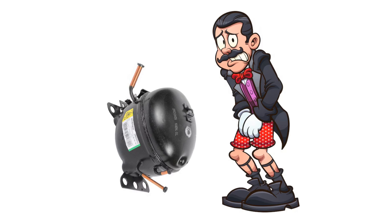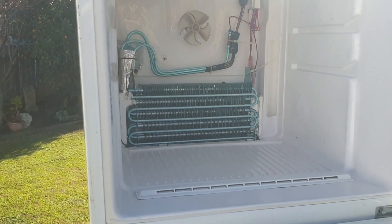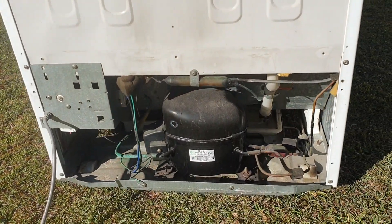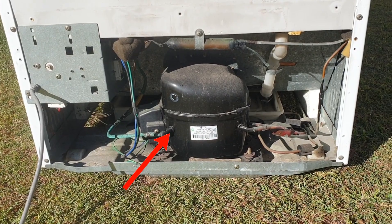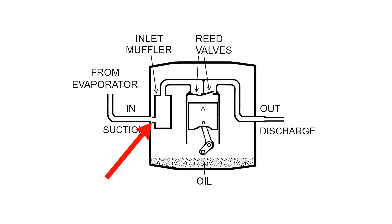That's it. And how do you remember that? Just think of a certain part of the male anatomy, and remember that if it's thick, it points up. So why does the thick pipe have to face up? The thick pipe runs directly from the evaporator in the back of the freezer down to the compressor. After it passes through the wall of the compressor, it just stops — it's open on the inside. There's a gap between the end of the pipe and the inlet to the cylinder intake. If you tilt the fridge so that the inlet pipe is facing down, the oil will pour straight into it.